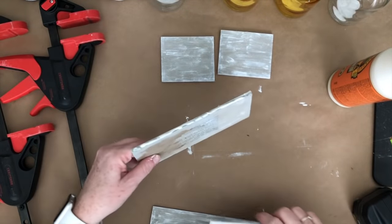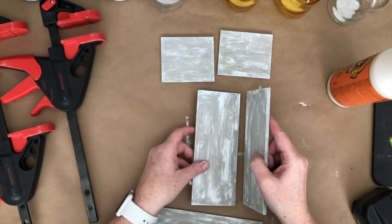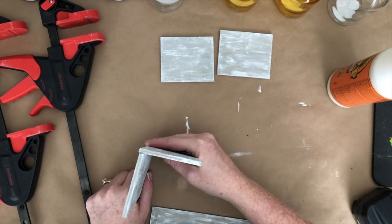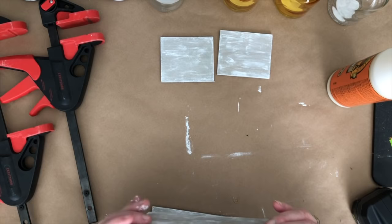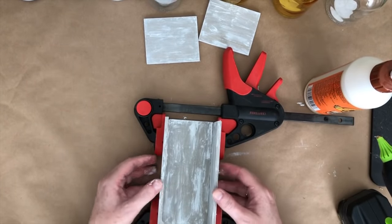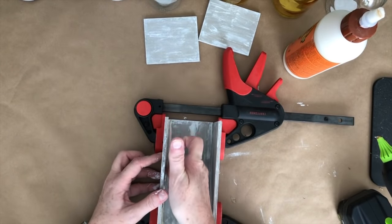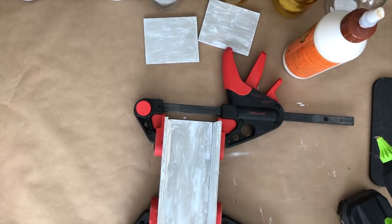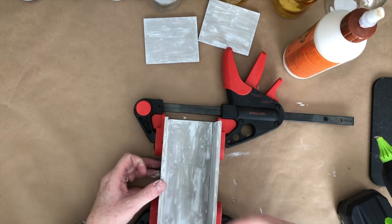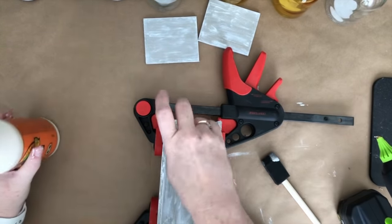Mine is the natural-drying one, but since it will be inside the box it won't matter. Just keep in mind that if it seeps out on the outside and you don't wipe it off, you'll get a slight wood-color tint. I'm assembling the box with clamps, and the best tool for pushing wood glue into a crevice is a foam brush — it wipes off the extra but also pushes it in. I'll get it sealed up and let it dry before adding the ends.